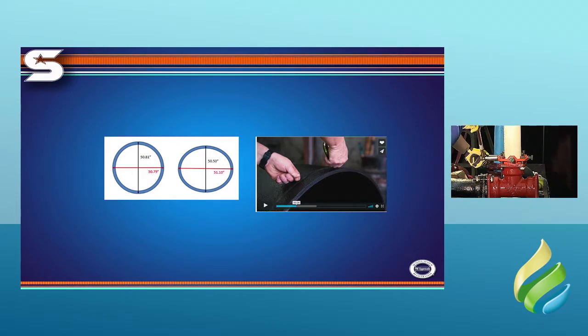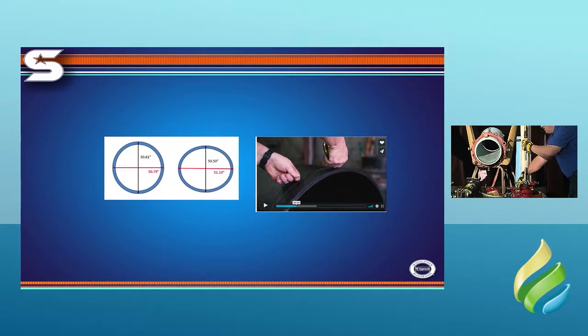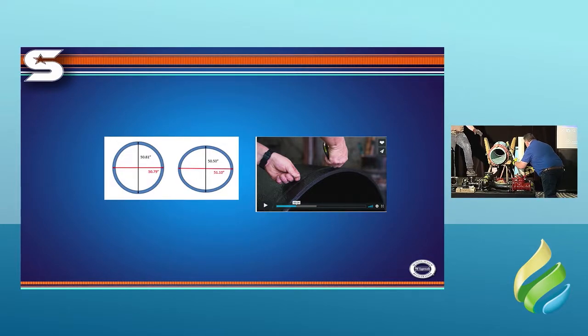And with us, as well as the other manufacturers, the wedge bolts have a break-off nut on them. That's a preset torque on that break-off nut, so you don't really need a torque wrench if you're doing it for the first time. You can loosen it off if something went wrong and retighten it. I think it's a 5/8 inch wrench you use to retighten. Then you need a torque wrench, and the instruction manual tells you what the torque is. But generally, you're just tightening it once. The bolts, Craig will show you, are just a break off.